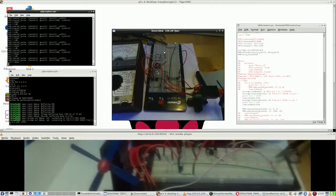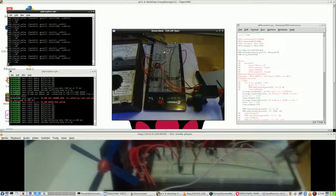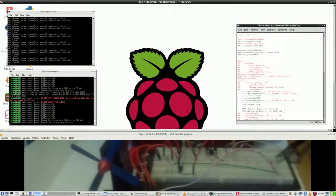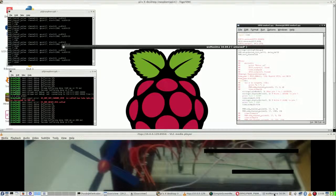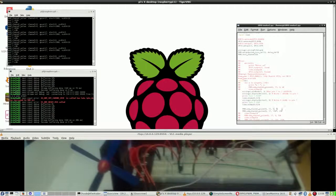So what did I do? First of all, again, examining with the wire intact how these LEDs correspond. Then with new found and received data, re-enabling these two lines, finding out that not everything works as it seems, but with this calculation finding out that everything is a milli, and it should be micro, so this should be 5 and 10. Would it work? Likely. Should it work? Yes. Does it work? No.